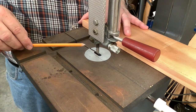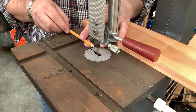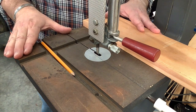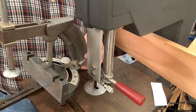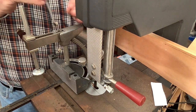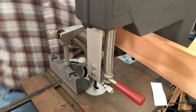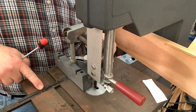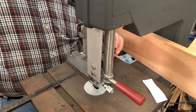In order to accommodate for the amount of drift we're getting with this blade at this tension, we need to set our fence to match that angle. Now the fence on the earlier model bandsaw with the cast iron table is in fact your miter gauge — the Shopsmith miter gauge is the rip fence for this cast iron bandsaw table. First thing you'll typically want to do is go ahead and remove the hold-down, as that's just going to be in the way when using it as a fence. There is a very large tapered set screw here in the fence bar that locks this in place.